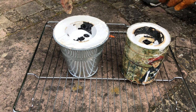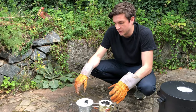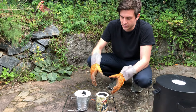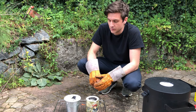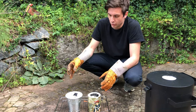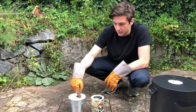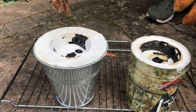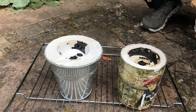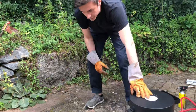I forgot to put a vent port in this one. These molds have been heated in the oven at 100 degrees Celsius for a few hours and then at 250 degrees Celsius for a few hours to drive out all the moisture and the plaster. As you can see, the PLA already melted a little bit and got removed. But now we have to remove everything inside, and for that we have to burn them out inside the furnace.